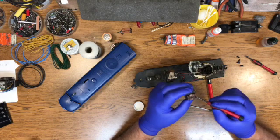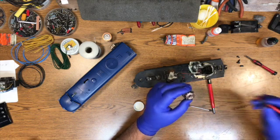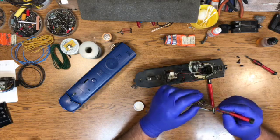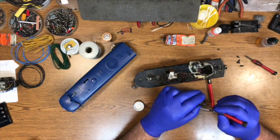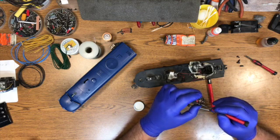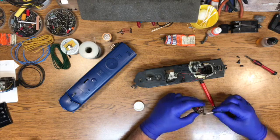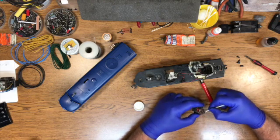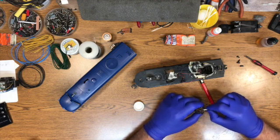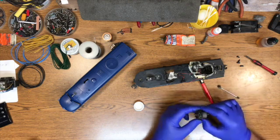He found that problem. He was able to connect it back together and resolder everything, and he got it working. He emailed me a couple of times asking what I thought the problem was and what I saw. I told him the symptoms he had and what I thought it could be. We eliminated things one at a time, and got to the armature, and I told him to make sure all the commutator plates are in good condition and connected, and that you have continuity in all three plates. And while he was doing that, he found the problem.